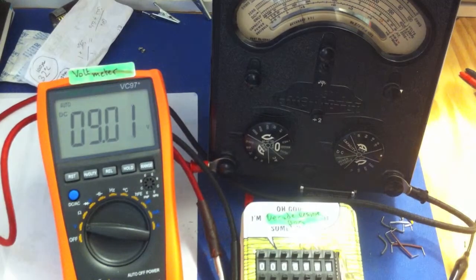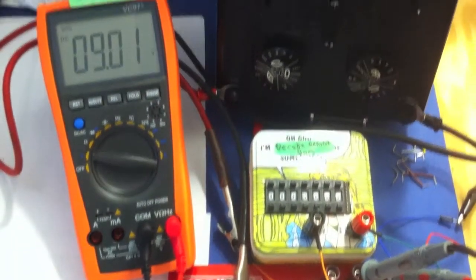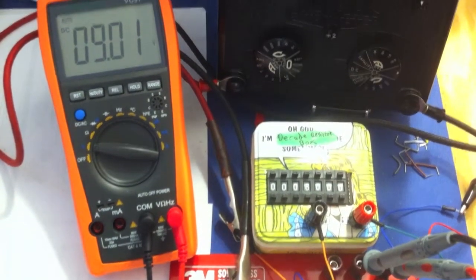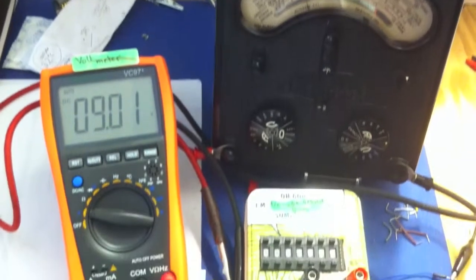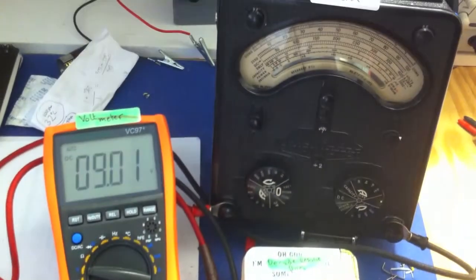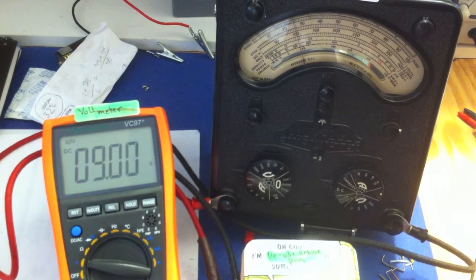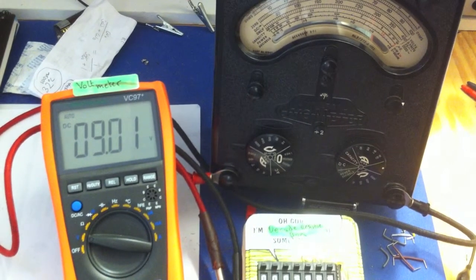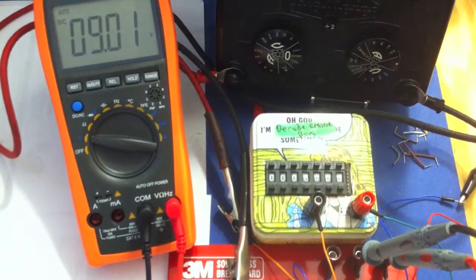So this is a good experiment. If you do this, you get a nice feeling, because you get good confirmation when you actually do the real thing. And it's really nice to see the numbers actually match up when you do an experiment. Although it might seem very simple, well, it is. It's a very simple circuit. But don't let that put you off. Definitely give it a go, because if you measure, like I say, the voltage drops across the 2 resistances, and then actually calculate the current and the voltages, then when these numbers match up, you'll actually learn a lot by just doing this.